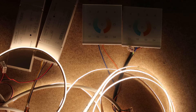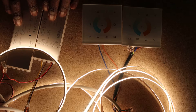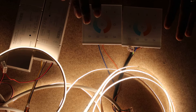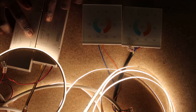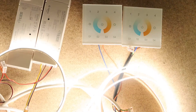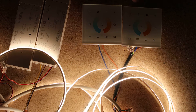The first thing you want to do is reset both LED controllers and wall mounts — remote controls follow the same step. For the LED controllers, you want to press the program button five times. Once you press the program button five times, it resets the LED controllers. Then you want to go ahead and reset the wall mount.